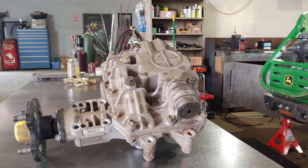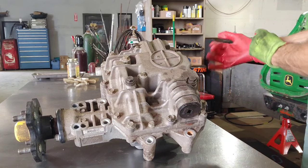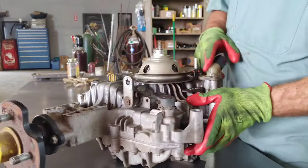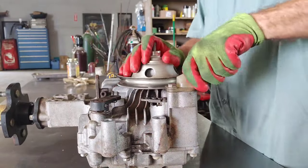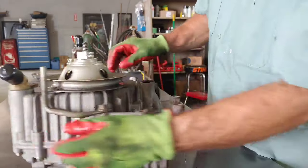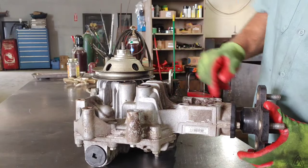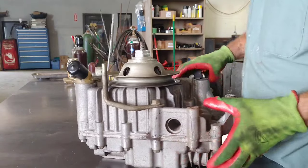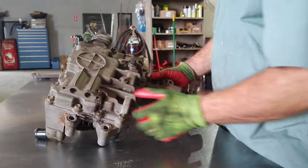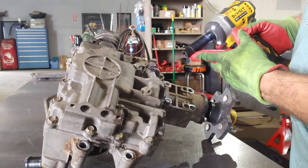I removed the hydro from the mower — I'll put a link in the description showing how to remove these; it's pretty easy. I've already cleaned this one off and taken the fan off. This pulley right here — I've already used my air compressor and cleaned this off really good. There is a rubber plug with a magnet right underneath that pulley. You have to take that pulley off to replace that rubber plug — those will dry rot and start leaking oil, as well as that input shaft seal right underneath the pulley. But this was fine in this case. I was expecting to see some carnage after removing this pan.